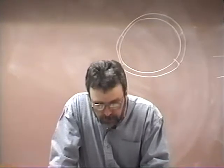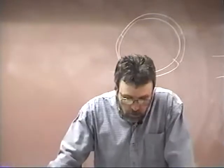So, first the electrode must be held so that it points toward the high side of the joint, as shown in figure 8-31, with respect to a perpendicular line from the surface of the weld. The electrode angle in a plane cutting through the weld joint should be 10 to 15 degrees, as before. The side angle should be 25 to 30 degrees, as shown, as it is in respect to the plane passing through the weld joint. The current setting and the arc length, that is one electrode diameter, are the same as used when the pipes are in the 5G position.